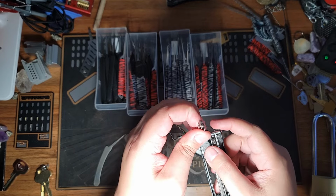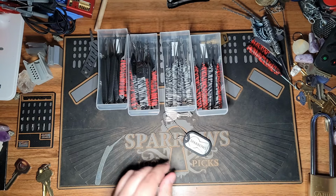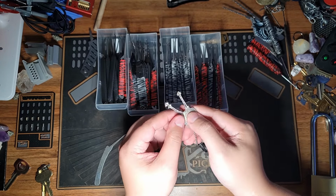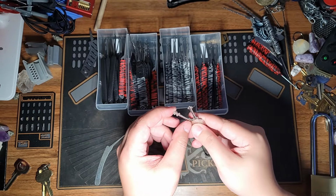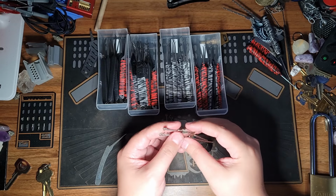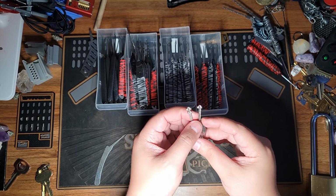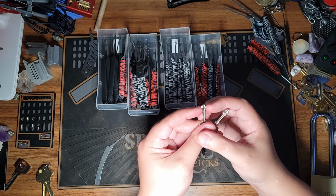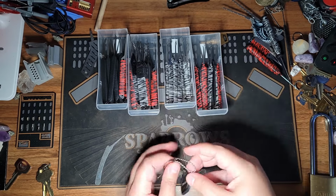And so what I did was I took some of the Master Lock extra keys that I had, and I took my Dremel and I made my own ward picks and all of that. So I'll probably do a video on how I did these. I mean, they came out pretty nice. This was the first set that I did. I actually have a collection of antique Master Lock ward keys that I want to make another set from because this one, there was a flaw in the key at the tip here, so it is a bit finicky, but it works. So those are my tools.